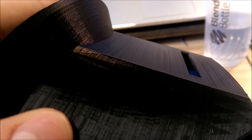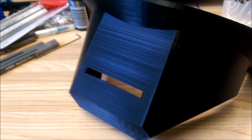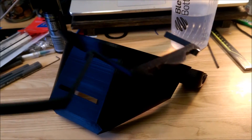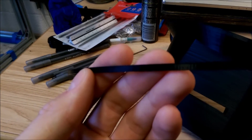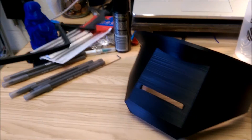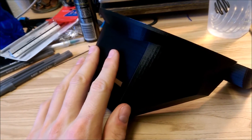The layer stacking is alright, it has some inconsistencies in it, and I believe that is because I turned up the voltage on the stepper drivers. I had started this print several times, and the first time I tried it, it just stopped after about the 15th layer or something like that, which had a lower voltage. The layer stacking on a lower voltage was much better and extremely smooth, but the layers would start shifting over and losing steps, so that was not good. I would take finishing the print over a little bit of quality any day.